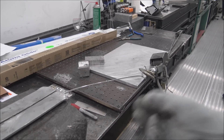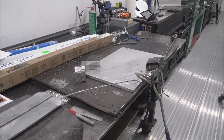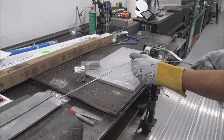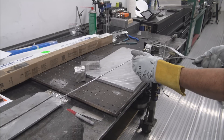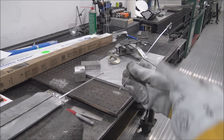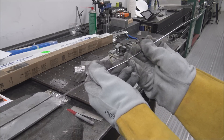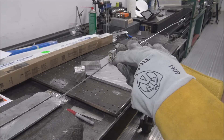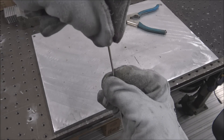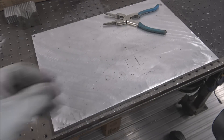High-tech tug-of-war test here — this one's the Lincoln rod weld joint and then the AlumaGlide here. That really doesn't mean anything because this rod was thinner so you'd think it would break first, and it broke right at the weld joint barely on the AlumaGlide side — but that could just be because it was barely thinner right there at the fracture point too. The right way to test tensile strength would be a proper pull tester, but that equipment's above my pay grade.